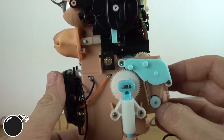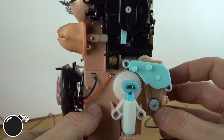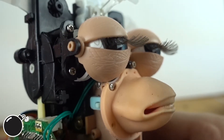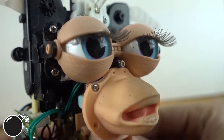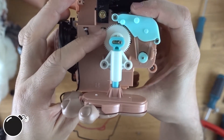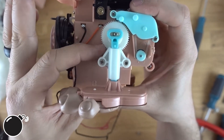It'll be interesting to see what goes to what. You can see there's a little lever right there that pushes out and makes the belly stick out. The legs are pretty straightforward — as this gear spins, this eccentric pin here moves in the slot and pulls the foot up and down in this channel. That's pretty straightforward.